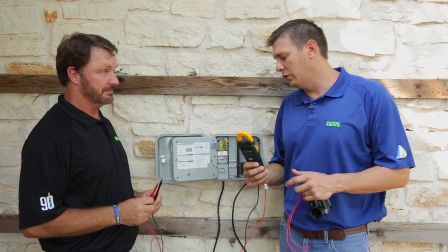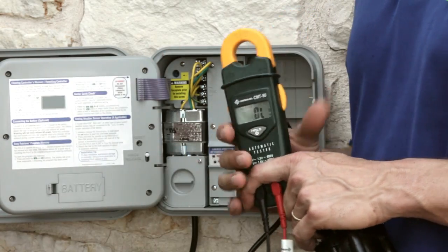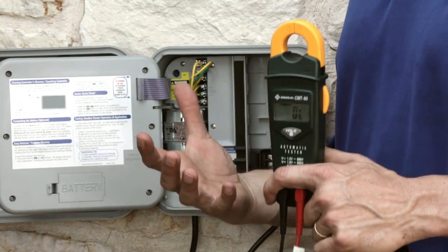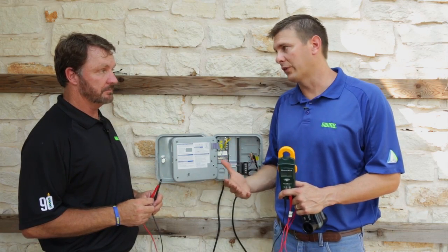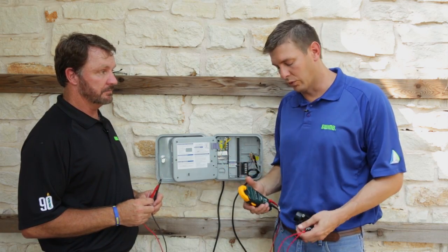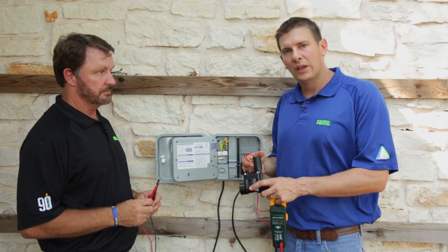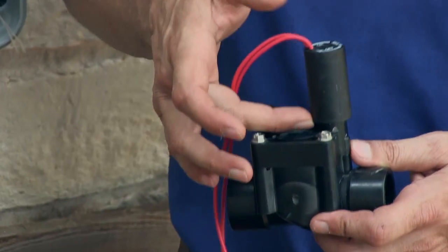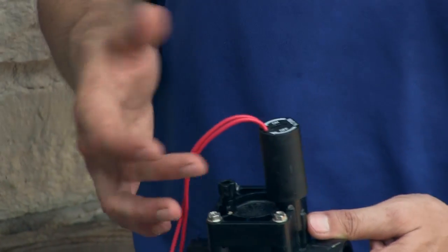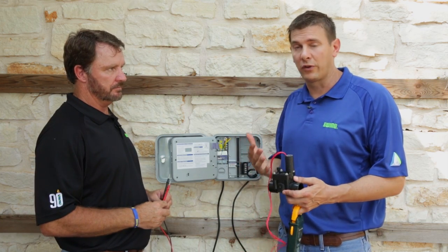What we're going to do is — this meter will send a signal down the wire and it's going to measure how much resistance is met in the wire, and the unit of resistance is ohms. That's why we're going to talk about ohming out a system. The great thing about a sprinkler system is that all the electric valves have solenoids on them, and they have a resistance reading between 20 and 60 ohms. So if we know that, we're home free as far as troubleshooting goes.